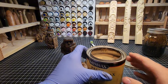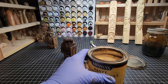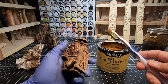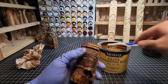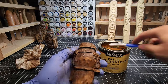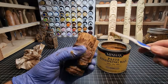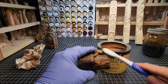Now we're going to look at the paste natural finishing wax — it's really dark in there. There are two options for heating it up: you can use a hair dryer, or you can take it outside and use a lighter to melt it. The proper safe solution is just a blow dryer. Heat it up, then take a toothbrush, dip it in the wet wax, and start applying it directly to the carving, pushing it into every nook and cranny, into the end grain, along the top, the back of the head, the belt — the whole carving.